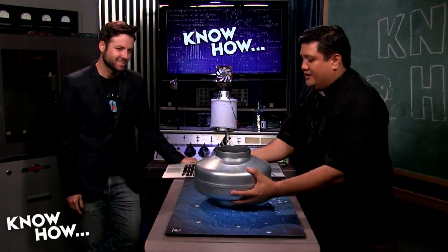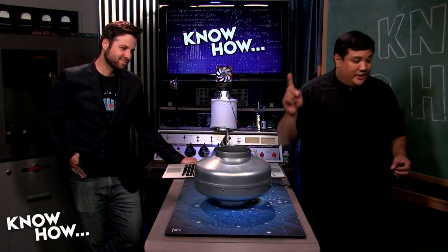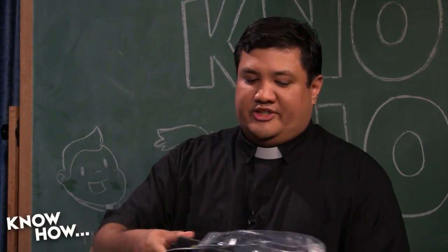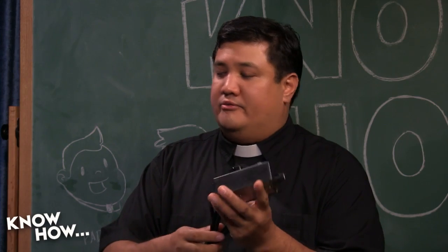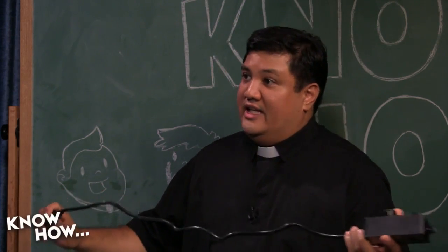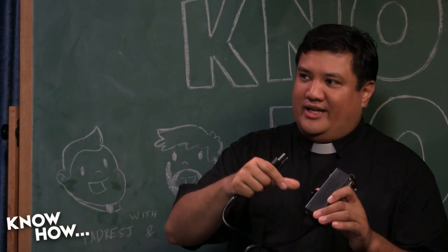Yeah. So know that it's going to make a lot of noise, which means we use something like this. This also came inside of the kit. It's a speed controller. What this will do is reduce the voltage that this fan is getting, and it allows me to run it either full speed, low speed, or mid speed. This allows me to buy a fan that's maybe a little bit larger than what I need, and then just run it at a slower speed.